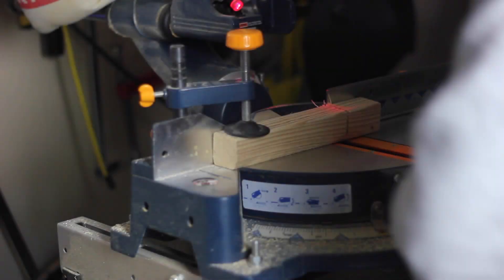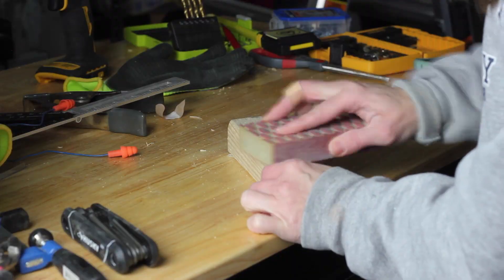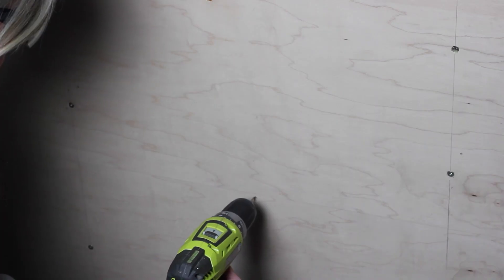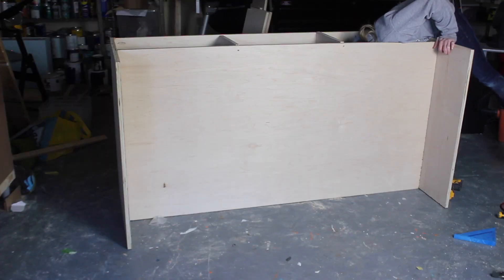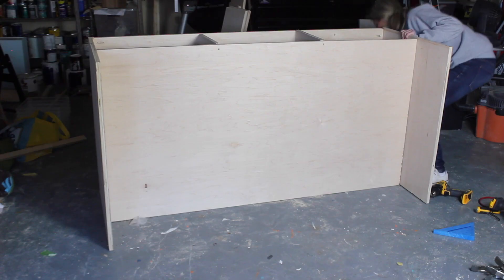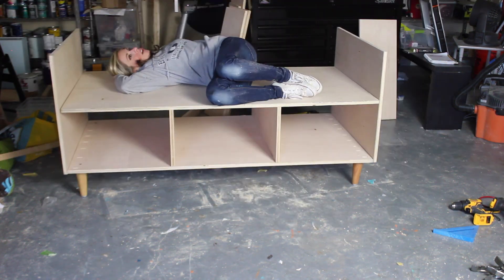I needed to make a center support leg for the bottom, so I used a scrap piece of 2x2, which I cut to match the length of the other legs — about 6 and 5/8 inches including the bracket. I gave it a quick sanding with a sanding block, then measured and marked the center of what will later be the bottom of the bed, and pre-drilled a hole and attached it with a 2-inch wood screw from the top side. I then realized I needed to attach the top board on the other side too before flipping, or it would be too flimsy, so I contorted myself into an awkward position and reached inside and screwed it on.